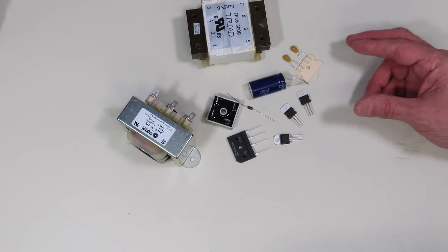Here's a demonstration of the effect of both a load and a filter capacitor on the output of a bridge rectifier. I've got a low current transformer — about 34 volts center-tapped — feeding into a bridge rectifier, and the output is on the oscilloscope. There's a great deal of ripple with no filter capacitor or output load. Notably, the bridge rectifier output frequency is 120 Hz, not 60 Hz — twice the line frequency, which makes sense since both halves of the AC waveform are rectified.